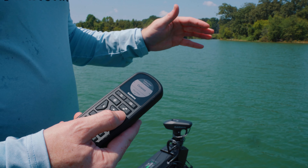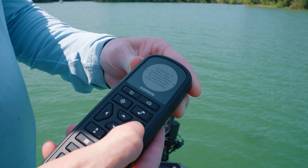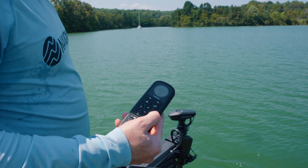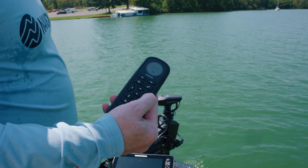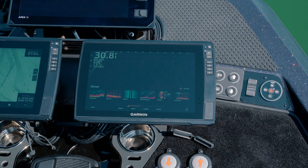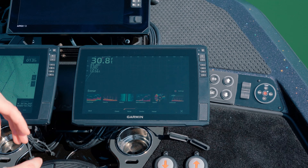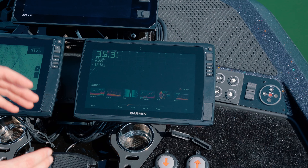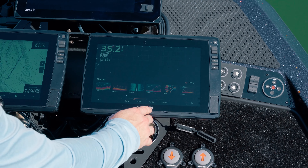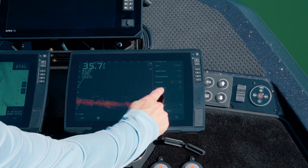Now that we've got the remote calibrated, we're going to calibrate the compass in the trolling motor, and that's done so that you can use everybody's favorite feature: anchor lock mode. We're going to go to the menu button, scroll down to settings, go over to trolling motor, then scroll down to calibrate, and hit calibrate the compass. You want to be in an area where you're hazard-free because you're going to spin the boat in a circle. Make sure you try to keep a tight circle — it just needs to go either left to right or right to left. Do like a clock spin, making sure you don't have a bunch of wake or any hazards the boat might bump into. We're going to hit calibrate the compass, and it'll tell you what you need to do on the screen and then begin.